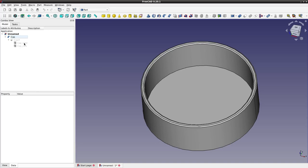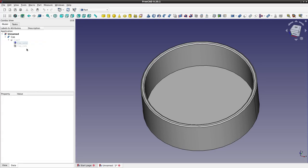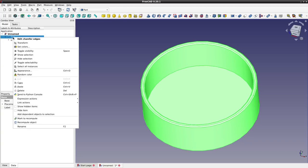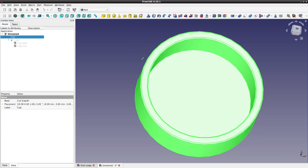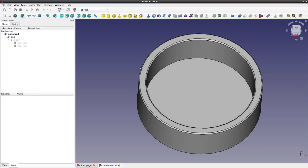So that's a basic example of how to build something with FreeCAD. Just a few words about the graphical interface. There are different ways of manipulating 3D models on the screen and you select the way you want by right-clicking on the background and going to Navigation Styles. I like the gesture method, but you can select whichever one you like. Another thing is visibility — you can make a model visible and invisible by clicking the spacebar. Just because something is invisible doesn't mean it doesn't exist.